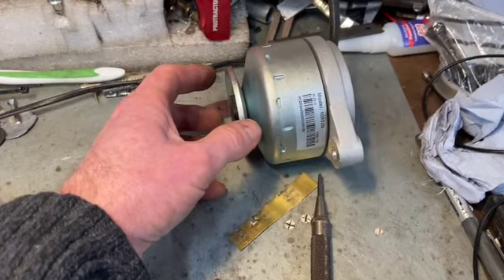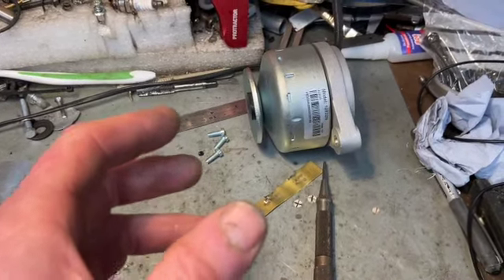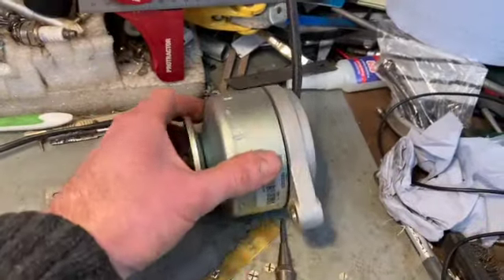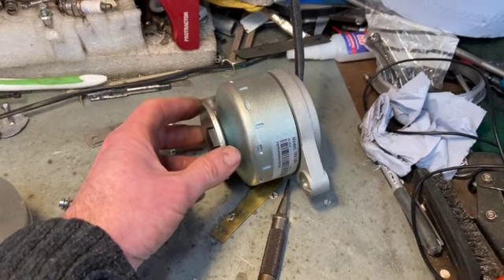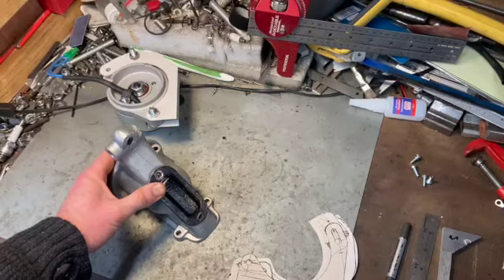My patience paid off — I managed to drill the holes in exactly the right place and tap them. I've sandwiched the front plate on, stuck it in the lathe, and taken out the hole a bit wider and machined both surfaces so you can't see the join. I will take out more material as it's a little bit heavy. For now I'm going to focus on the alternator and making a bracket to fit it to the housing that originally held the dynamo and distributor. Time to get the cereal packets out and do some CAD — cardboard aided design.